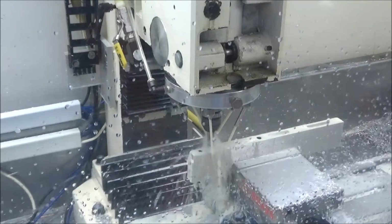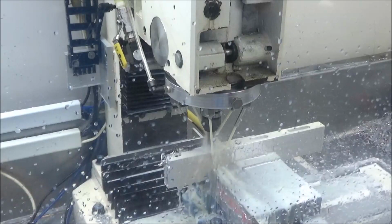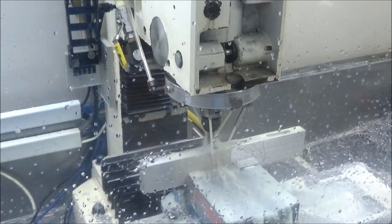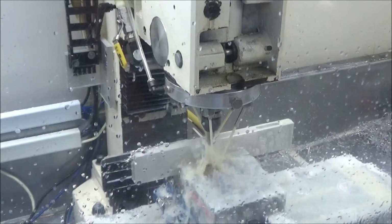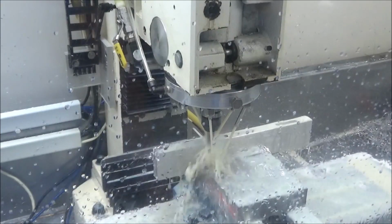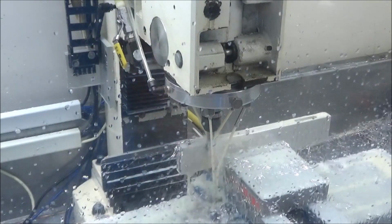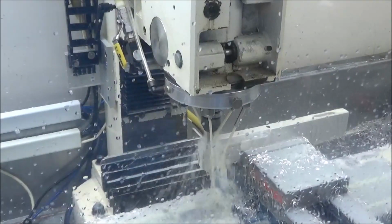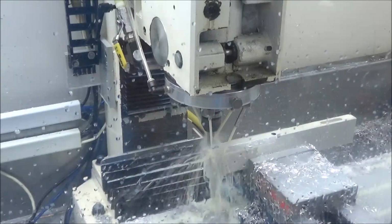They kind of work on the spindle speed there. Kind of stuck out a little ways on the end there too, so that's probably where a little bit of that chatter came from, but being an adaptive clearing, it's not going to make much difference on the finish. It's going to get milled away anyway. Starting to lose our path of view here, but get a little bit of chatter out of it.